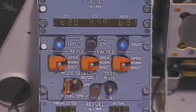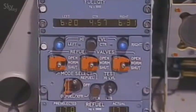The fuel stops for approximately five seconds near the end of the refuel operation. This lets the computer calculate accurately where to put the last of the fuel. When refueling is completed, the computer illuminates the end light. The actual and preselected quantities agree, within 100 kg tolerance.